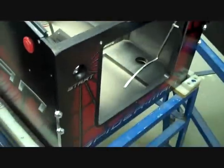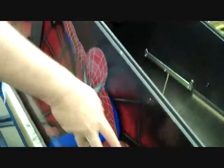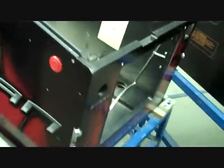Now over here starts the cabinet line. These cabinets are made out of plywood, and they're held together tongue and groove. So this is also made at Churchill, who makes the play fields. They'll silk screen this by hand, the same thing as the play field. They do that at Churchill? Yes. All the paintings? 4-color processing, again, yellow, magenta, cyan, and black. And then they put a light varnish on it, and it comes over here.